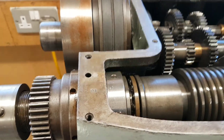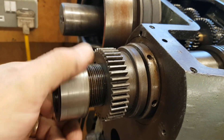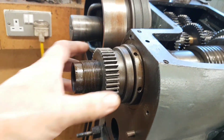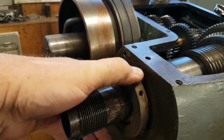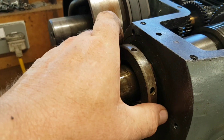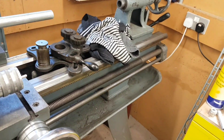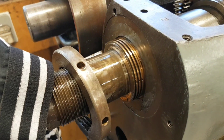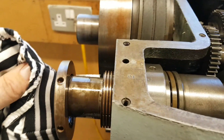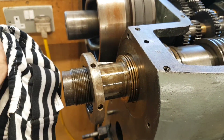So this controls only one element of the three bearing system. Let me just push that back forward again. If I take this off and put it somewhere sensible so I don't lose it - that's a rolling or mating face, or running face. And then the point I wanted to show you was something I've never seen on a bearing before. If I give this a little wipe here, you'll see the bearing is threaded. And it's also threaded on that end. So it's a tapered bearing that you can adjust by pulling the locking nuts back and forth. That's the interesting part - I've never seen it before. I thought this is the reason I better share it.